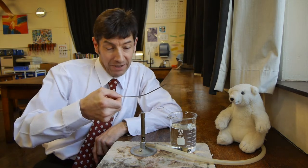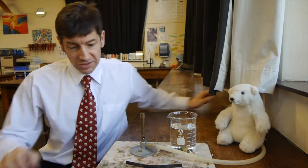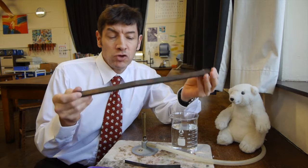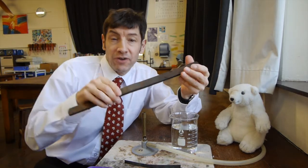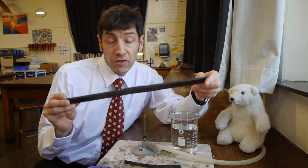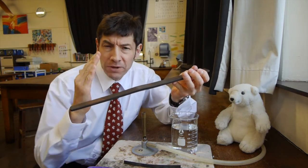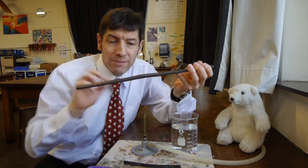To explain what's happening I need a rather larger sample. This is a bimetallic strip that's much bigger and — the hint is in the name — it's made of two metals: some copper and some steel bonded together very tightly with rivets. What's interesting is that those two metals have different thermal expansion coefficients. When you heat them to a given temperature, one gets longer quicker than the other, and that will be the one that bows outwards — it will be the top of the bow because it's growing more than the one underneath.